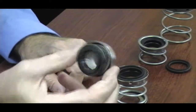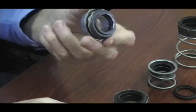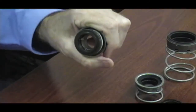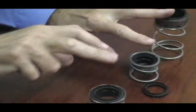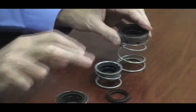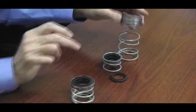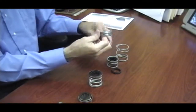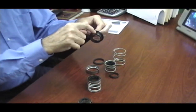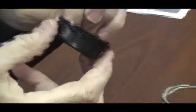This seal head type is special — the shaft passes through it and it doesn't rotate with the shaft. It stays inside a pocket in the pump cavity or up against the impeller. These two types are a little more expensive generally than this type. The elastomer inside this bellows is shaped with an extra convolution, which gives it a longer extension as the carbon wears.